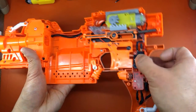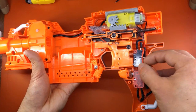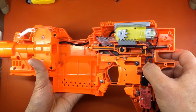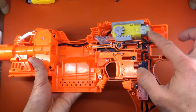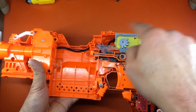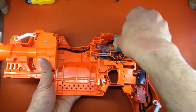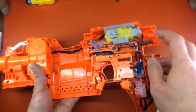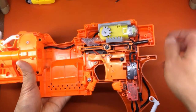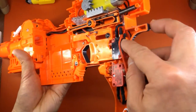The difference is with this second switch — you go from the common to the normally open. From there, a negative wire goes to the negative terminal of the motor. You'll need to do a polarity check to make sure it's spinning in the counterclockwise direction to push the rack gear. Once you have that determined, if it was the other way around you flip the motor — then it would be on the top terminal — and the positive terminal goes to the common.